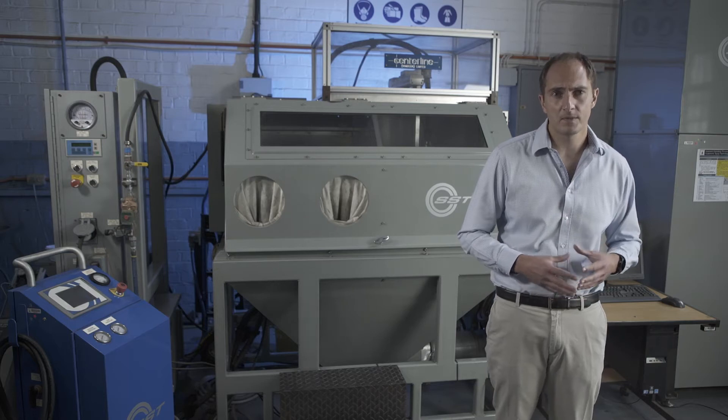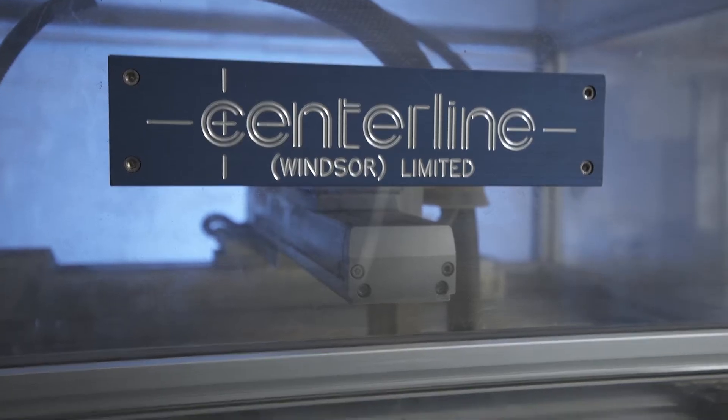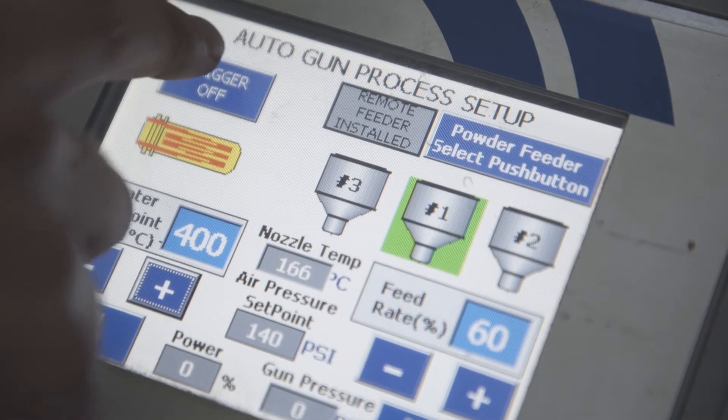At the WITS Labs, our cold spray machine is classified as low pressure. Low pressure cold spray machines tend to be better at spraying ductile materials such as zinc, magnesium, or copper. There will still be some level of wear at the lower pressures, but nowhere near as much as with the high pressure cold spray machine. This specific cold spray machine operates generally at around 10 bar, and if you use a pressure booster that sits behind the machine, you can boost it to 18 bar.